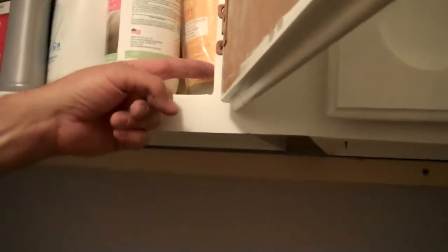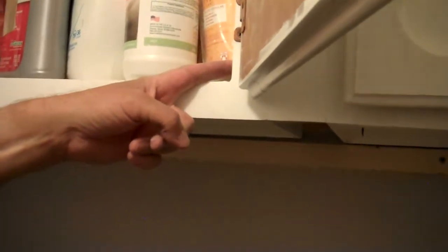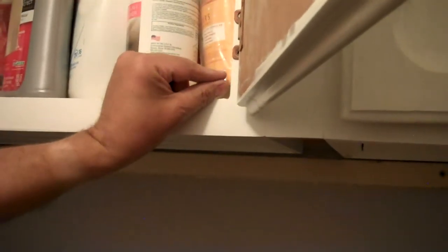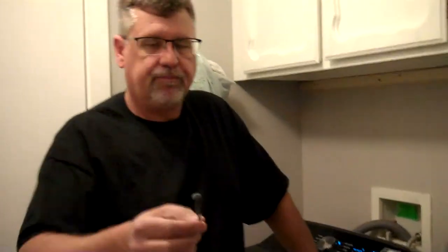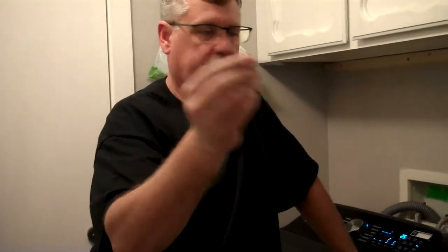So these I did with Phillips screws because it's the laundry room, I didn't care. But they do make a special screw with a square tip for joining your two cabinets together. Then you can tighten everything up once you have them together. Then put your cabinets tight against the wall. Okay, so while we're talking about screws, this screw is what they sell to install cabinets with. So make sure when you go buy screws, you buy the correct screws, because these really go in well.